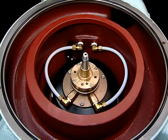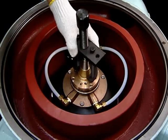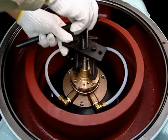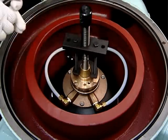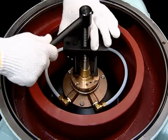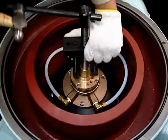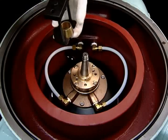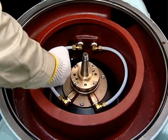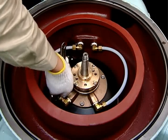This is the procedure for removing the water supplying device. Set the disassembly jack, push bolts, and hexagonal bolts on the bowl bushing jack. Gradually tighten the handle to release the bowl bushing jack. Remove the cap nuts from the operating water inlet pipe of the water supplying device.